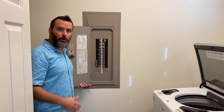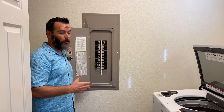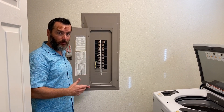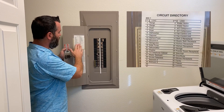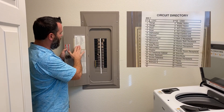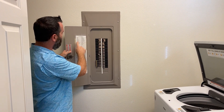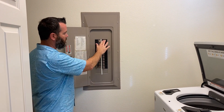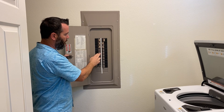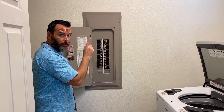The first thing you want to do before you start flushing your tank is come into the breaker panel, which may be located in the garage or on the first floor of the home. Once you locate it, look for the circuit directory on the inside of the cover — that'll tell you which breaker belongs to which fixture. Locate the solar pump and water heater breakers and turn those off. Very important that you do this first.